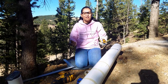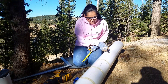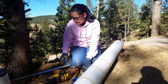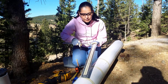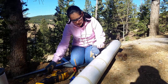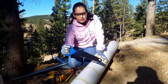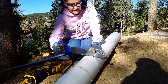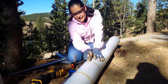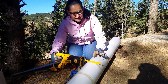Now I'm going to show you how to cut the pipe. The first step is measuring and putting marks at the right distance. The next step is using regular masking tape to draw a straight line — I cover the dots with the masking tape so it gives me a cutting path. The third step is using my manual saw to cut on top of the black line, replacing the line with a groove, so when I come to step four with the saw it already has somewhere to go and it's much easier to cut straight.